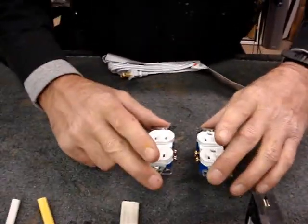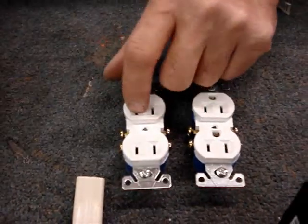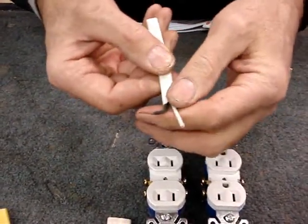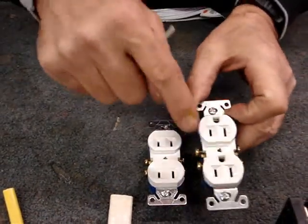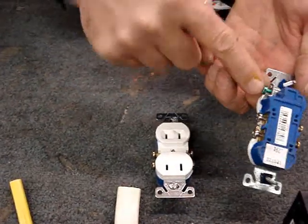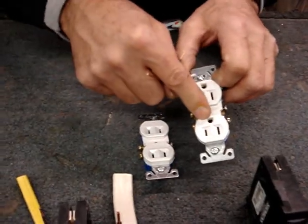When we go to the receptacles in your house — if your house was 1955 or older — your wiring is only two-wire wiring. You have a black wire and a white wire. You will not have a ground wire. That's all that will be in your electrical boxes. So if you go and buy a grounded outlet with the third hole and install that in a location where there's only two wires, you are unsafely providing somebody with a ground that is not hooked to anything. Running a wire from the ground to the electrical box did not achieve anything unless the electrical box is grounded, which in 1950 they weren't. So don't be too quick to take out all your two-prong outlets and put in three-prong.